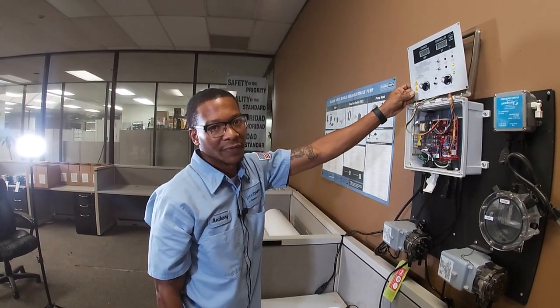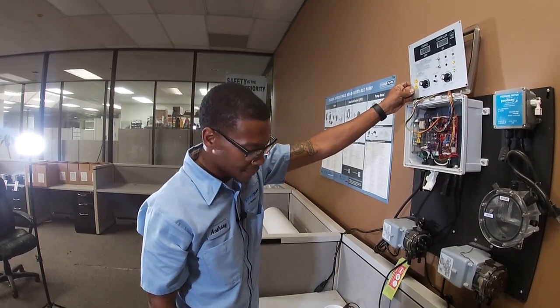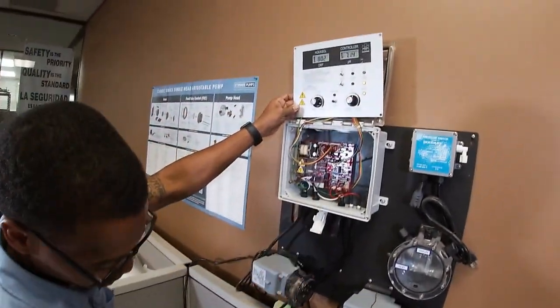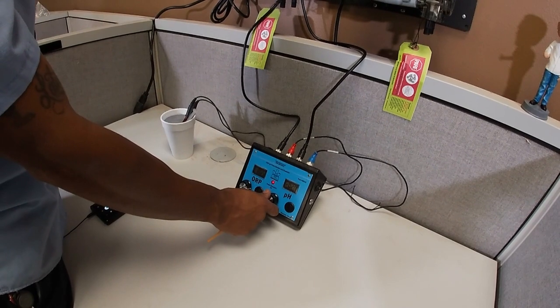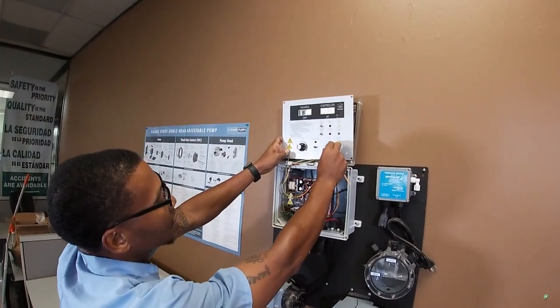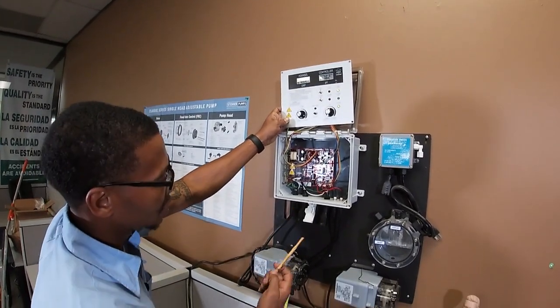So that's actually what we calibrate here — the factory specs. That's your starting point for mount. Now on the pH side, we're going to start off with negative 28 millivolts. You're going to adjust your signal generator to negative 28 millivolts — that's about a 7.5, so that's where your feed light should kick on and off at. Now pH priority is on.